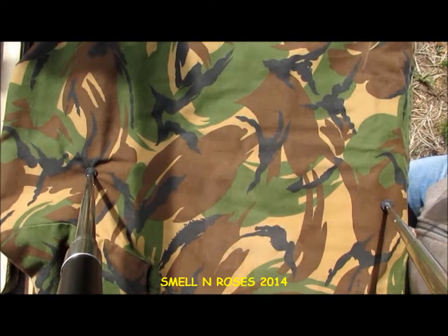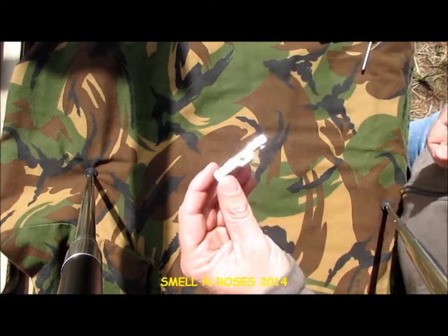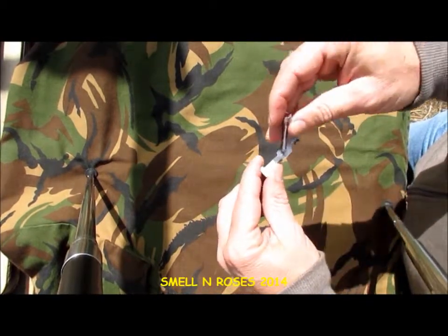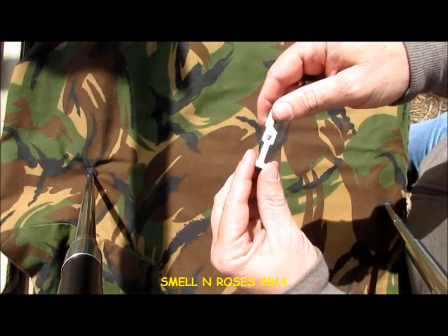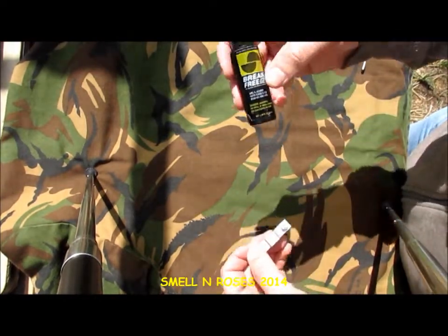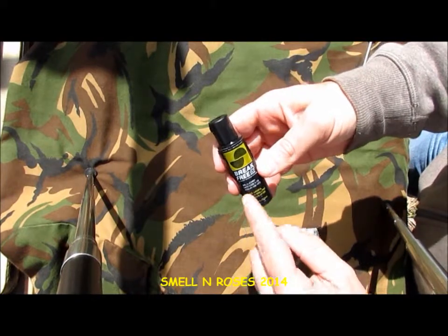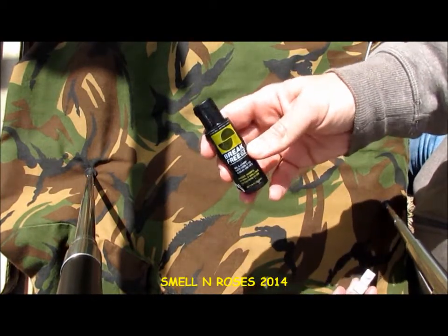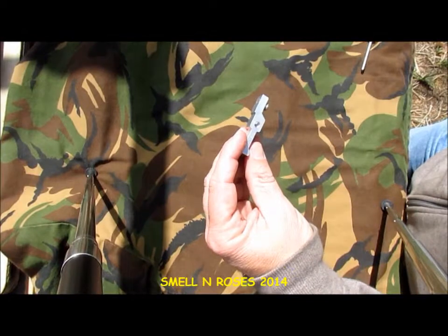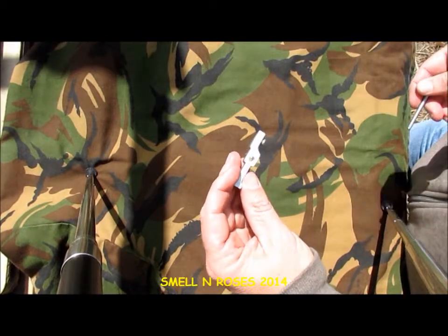Let's get this thing put together and see what it looks like. One thing I noticed when I disassembled this part is that you've got a piece of milled aluminum and a steel screw — so there's a little bit of incompatibility of materials and the threads in there can get gummed up. That's pretty typical with aluminum. I put a little CLP Break Free in there, which is really excellent stuff. I like it on firearms, carbon steel knives, appliances — anything where there's metal on metal. I've got it rubbed on the threads of my screw to see if that helps out any.